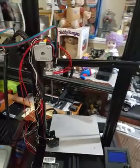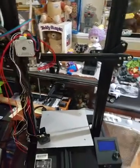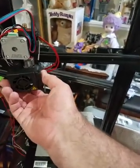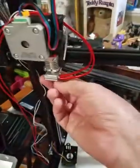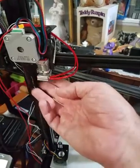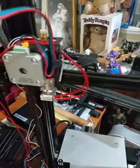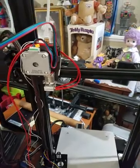So I decided to install that. Right now, the temperature rises up — it goes fine. It did go over a bit, and I'm not too concerned, because I had taken out the fan and forgot to install it, just to see if it actually reached temperature — in case it was blowing too hard and cooling the hotend too much, inducing an error. But that wasn't the case. I placed it up in front, it dropped down to 205 degrees, then kept going up, stopped at 211, and maintained itself stable.